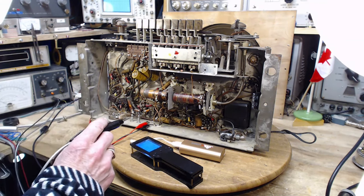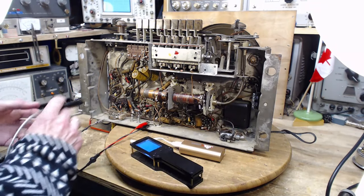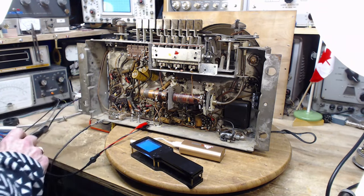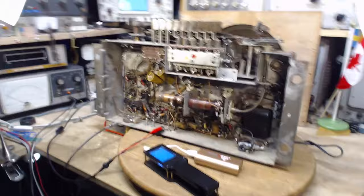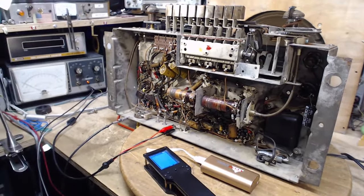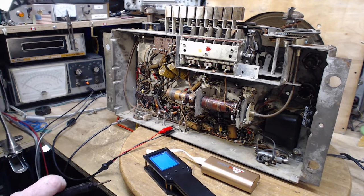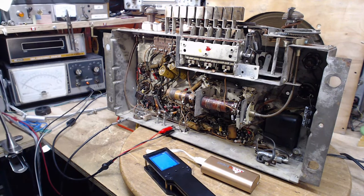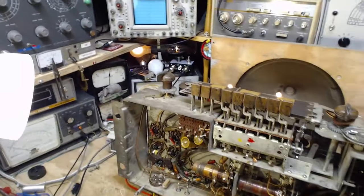What am I doing with the voltmeter? I want to measure here, input, and then measure output, one of those two sides. Got this in parallel. Yes, it's correct. Fooling around with the power supply here, if you're going to make a mistake, you better become aware of it before you fully implement the disaster. I don't think any disaster's coming here. I'm going to start this off with the dim bulbs and switches on. Yeah, here we go. You might say, oh, Jim, you're overly cautious, but can you really be overly cautious? There's the dim bulbs going back there.